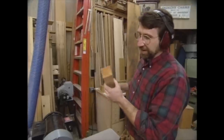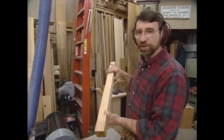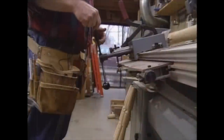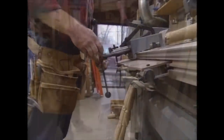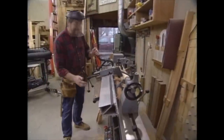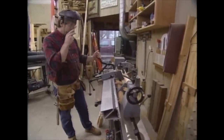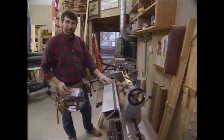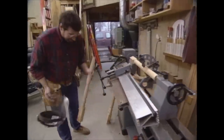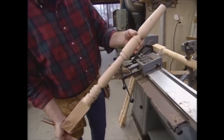In the last few minutes I've been making these square blanks from some more recycled pine, and I'll turn these for the legs. I am one lucky woodworker — I have this lathe duplicator attachment that goes on my lathe and allows me to make multiple copies of a turning quite easily. I start out by making a hardboard template which has the profile that I want to turn cut into it. On the machine there is a pin which follows the profile, and at the other end there is a little cutter which actually cuts the wood. It's a lot like a key-making machine — very accurate, very fast.